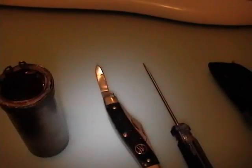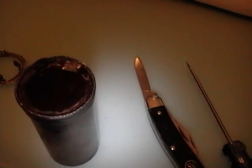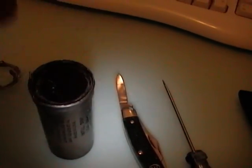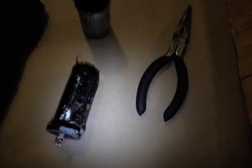I finished uncrimping the can — I got it started with the pocket knife, then switched to a small flat-bladed screwdriver and worked my way around uncrimping the edge. With it opened up, I removed the metal ring. The aluminum foil tab is one side of the capacitor pressing against the metallic can, and the other connection goes to a separate terminal. I heated the can with a heat gun on low heat, applied steady pressure with heat-resistant gloves, and eventually pulled the insides out with long-nose pliers.